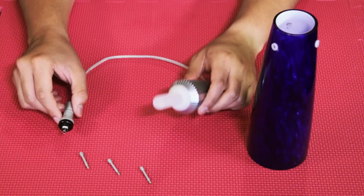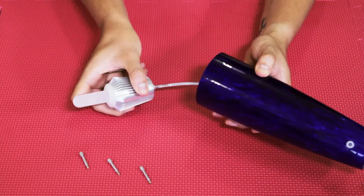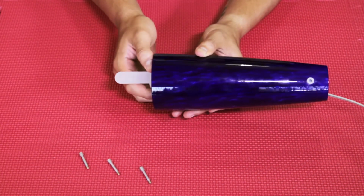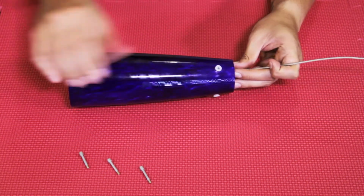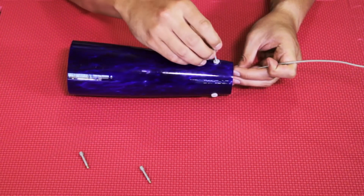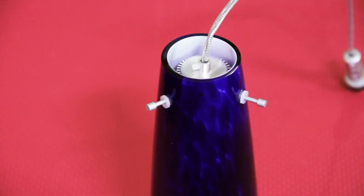For plugs installed indoors, completely exposed to circulating air and potentially air conditioning, the Plugz heatsink acts as the final surface from which convection occurs, and therefore the hot air is not stagnating around the product. In this case, a simple finned heatsink with adequate surface area would suffice.